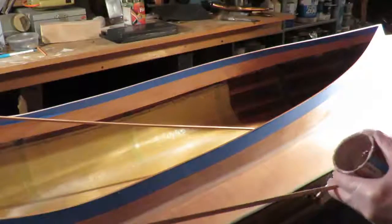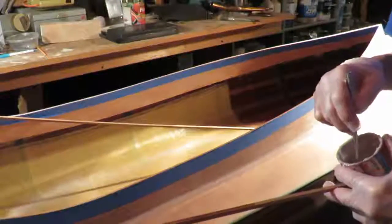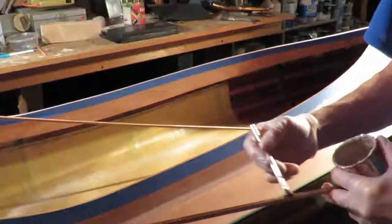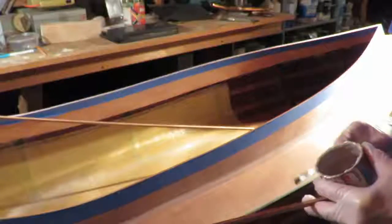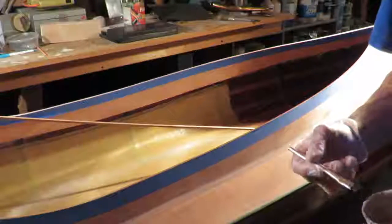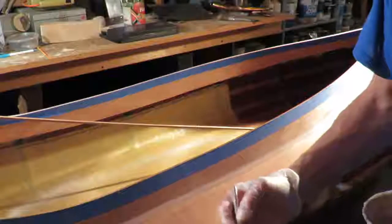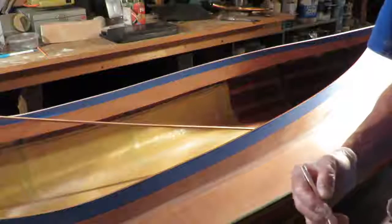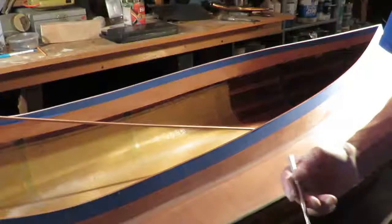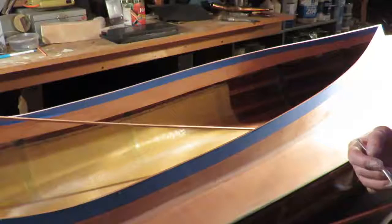And then we'll want to coat things with the silica mixture. We'll put that on the boat itself, on the top edge of the coaming. We want that coating to be thick enough that it squeezes out a little bit everywhere, but not very much. This is somewhat more of a decorative piece than a structural piece. We just don't want it to fall off ever, so we don't need to be quite as astute about our gluing technique as when it's a structural joint.